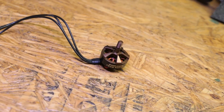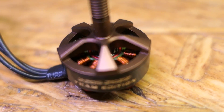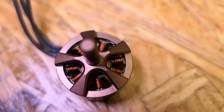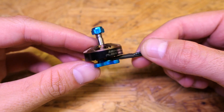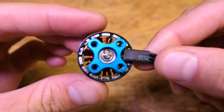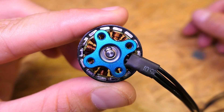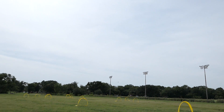Now let's get on to it. These particular Hyperlites are 2205, 2522 KV. When most people are running 2206, 2207, 2306, or bigger, why am I testing 2205 motors? Because I recently was flying the Hyperlite 2204 size motors on a 200 gram rig and I absolutely loved the efficiency I was getting with that setup. The thing I didn't love was the flight characteristics in that weight range. My goal with these motors is to find out if I can get within a comfortable flying weight range while retaining that same great efficiency I got on the 2204 size. After flying with them for a couple weeks, I now also think we may have made the jump from 2205 a little too soon, but I'll talk more about that later.